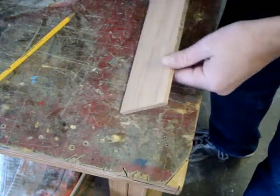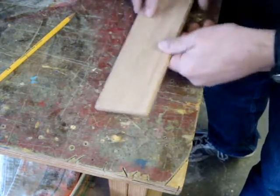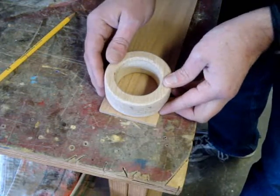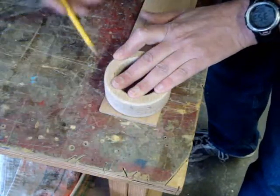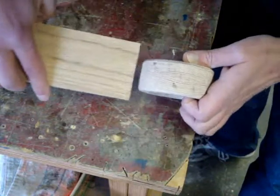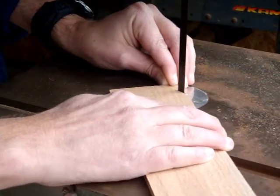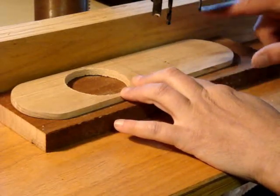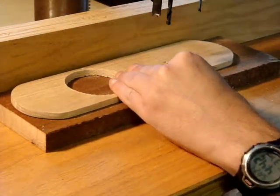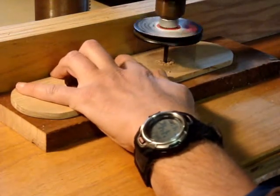To make the panel that's going to hold the pots, I took a piece of oak and I re-sawed it and planed it down to ¼ inch thick. Since this project is all about circles, I'm going to grab one of the little wheels that I made and just kind of line it up evenly so I'll be able to use that mark to cut a rounded edge for where it fits into the inside of these circles. Now I'm just cutting that out on my band saw. To cut the holes for the pots, I've got this hole saw jig — a little tool that you can expand to any size that you need — and that's going to work out just fine to cut holes that are just a little bit smaller than this piece of wood itself.